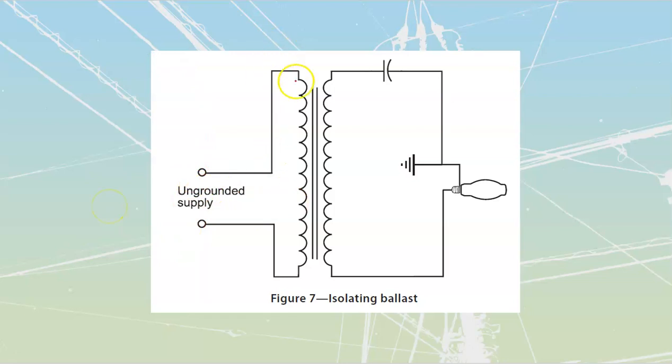When we do have those series connections, we are going to have to ground down one side of the secondary circuit. If you take a look at the secondary circuit as is, I'll just remove that, you'll see that there's no point that is connected over to ground. Absolutely nothing connected to ground. We can pick any point inside of our circuit to ground down. So if we pick a point, we're going to pick a point that's going to be attached to this. Now, this is usually done by the manufacturer. It shouldn't be done by you.